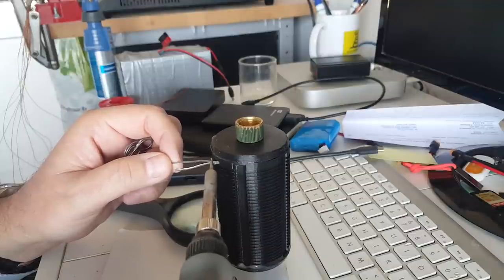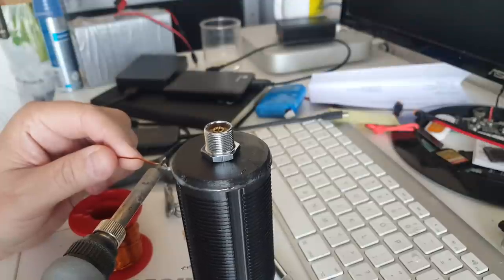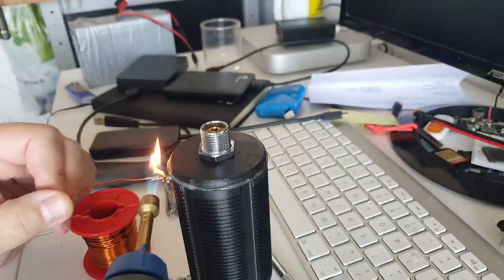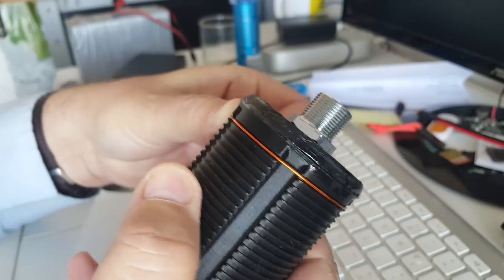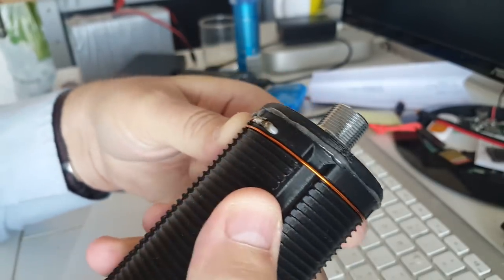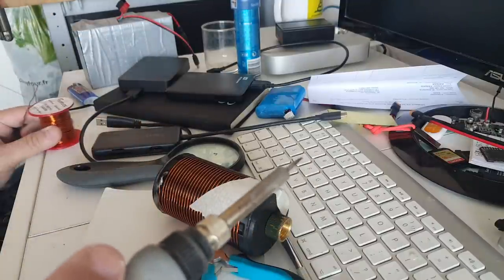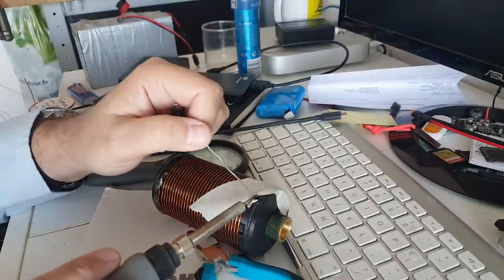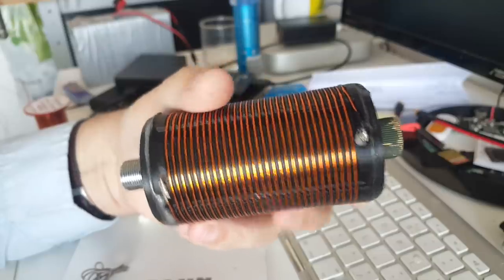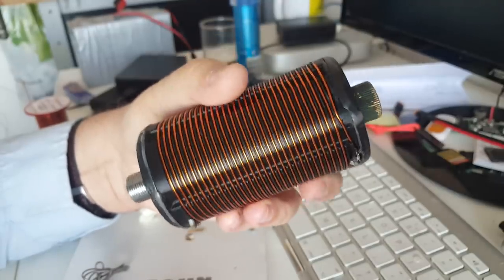I'm going to thread the wire through the hole here and put the antenna socket right here, then put some weight on that. Now let's tin the wire so I can solder the enamel wire on it. All that copper is acting as a heat sink, so my soldering iron has a hard time. I'm putting in a 1-millimeter enameled wire as tight as I can around the coil form. Just add some solder — that should help. I'd say that's a win.